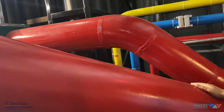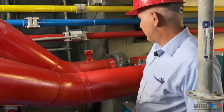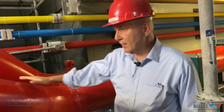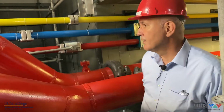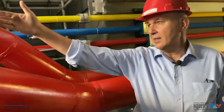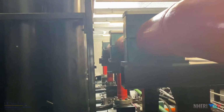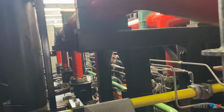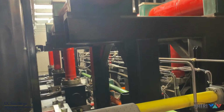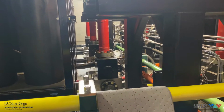These took a long time, and they had to be x-rayed as all the other welds. And these are, again, huge pipes, 12-inch diameter inside, 1 1/4 inch thickness. So you see, again, there they are coming out from between the 2 accumulator banks here, which release the oil through some blowdown valve that we can see here in the view of the camera.